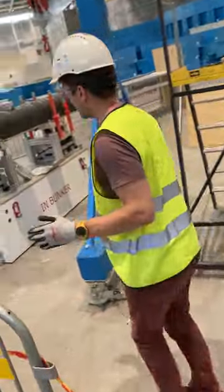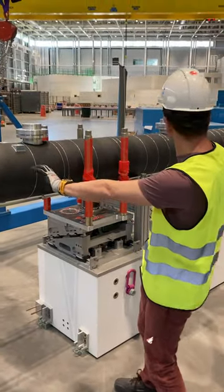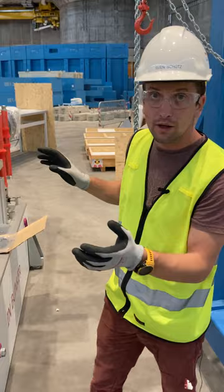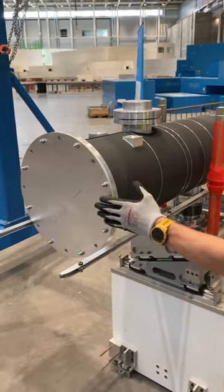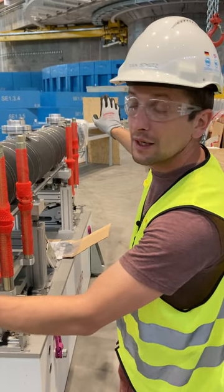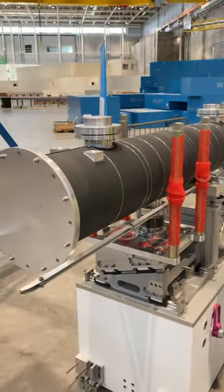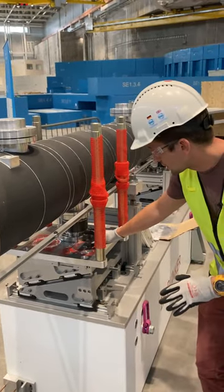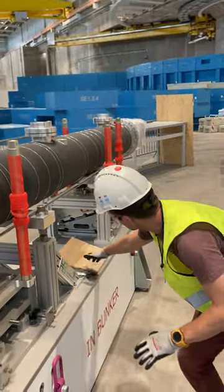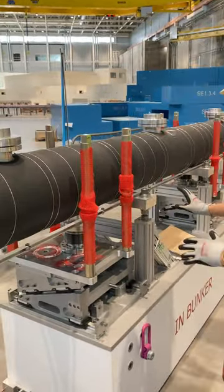When we go to our feeder, basically what we have is a piece of guide which goes over the whole length of this tube. Within the tube, that piece of guide has to be in vacuum, because starting here at the upstream end of the feeder we will have one single vacuum all the way to the sample. Everything is connected, so we need a vacuum chamber — which is what you can see here. Inside, you have the guide standing on kinematic mount feet; you can see the upstream foot here and the downstream foot there. The guide is separated from the vacuum chamber through those bellows, and the vacuum chamber is then sitting on its own feet.